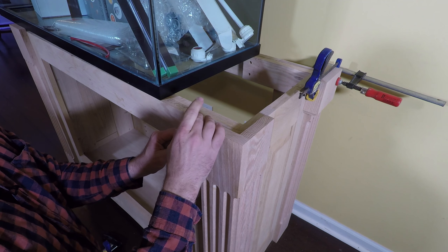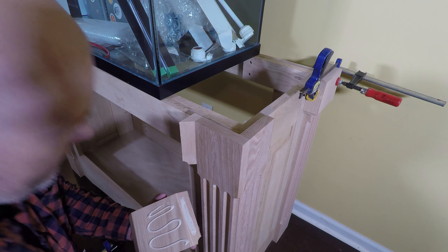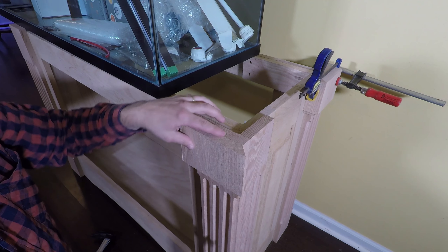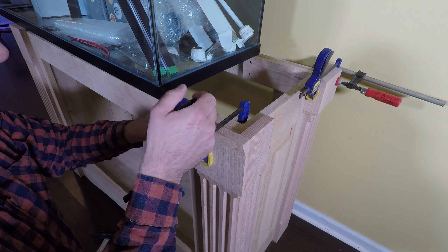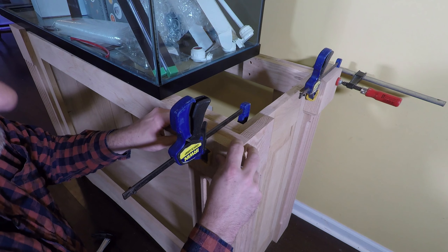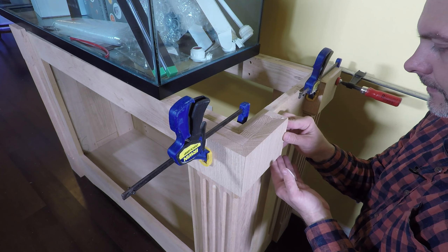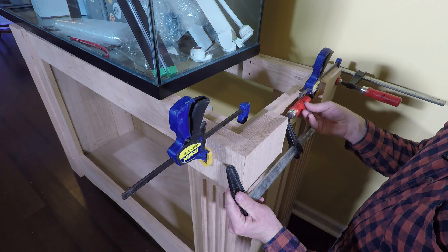Making sure that the top is flush with the top of the flute board. I'll apply some glue to this face and this face. And with that in place, I can go ahead and clamp this one. Just be aware that when you clamp, oftentimes it causes the wood to move a little, so you want to double check and make sure that everything is exactly where you want it after the clamp is fully seated. I can add additional clamps to hold everything in place while this piece sets up.